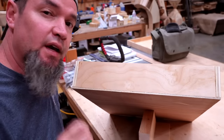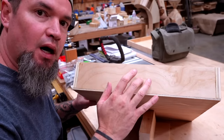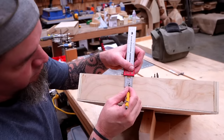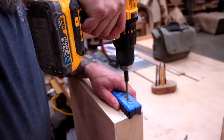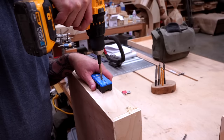With our brackets finished, we only have one more set of holes to drill — on the short side of our box. The first hole is one inch in from the back and one inch down from the top. The second quarter-inch hole is six and a half inches from the back and one and a quarter inches down from the top.